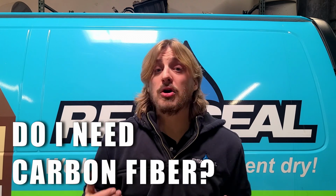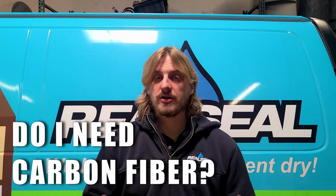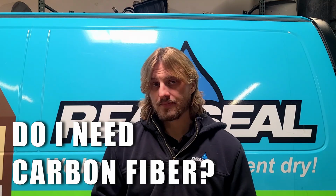Now, hearing all of this might prompt you to ask yourself, well, how do I know if I have an issue? The telltale signs are easy enough for any homeowner to spot. You can look on the outside of your foundation wall. And if you have brick above your siding, there'll be a telltale horizontal crack in the brick. And then at the end of that crack on either end, you might see some stair-stepping cracks down to the corners of the foundation. This is caused because as that wall moves in, it causes the brick above to bow, which will create a horizontal crack where you will see that movement of the brick.